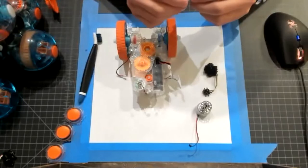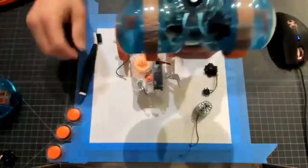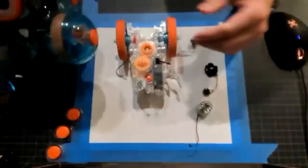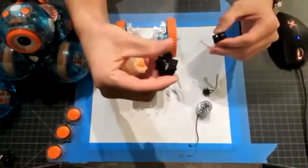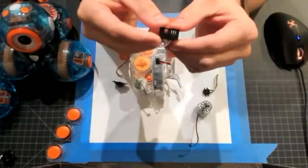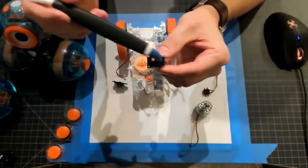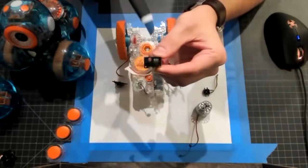A second one that we mentioned in the overview has to do with the distance sensor pairings. You can see them here in these black regions. It's a special type of plastic that permits infrared light to go through, but not visible light. And behind those lenses, like this one, my hand here, you'll see a PCB and wire harness, but on top of that is a black ABS housing cover. And the feature of that are these apertures, these special shaped holes. This is a semicircular hole where I'm pointing now, and then a small pinhole on the other side.